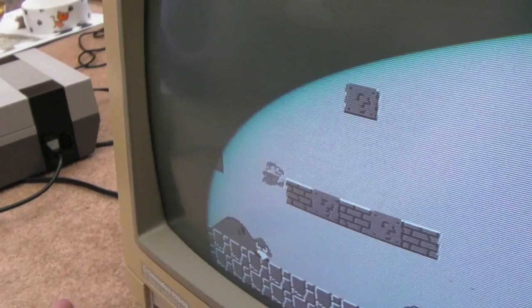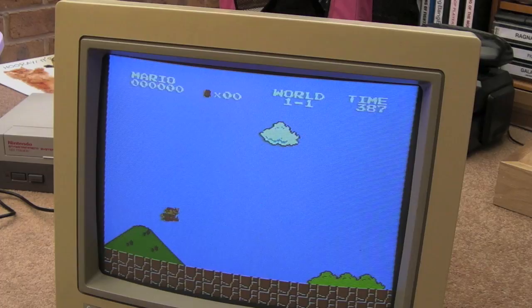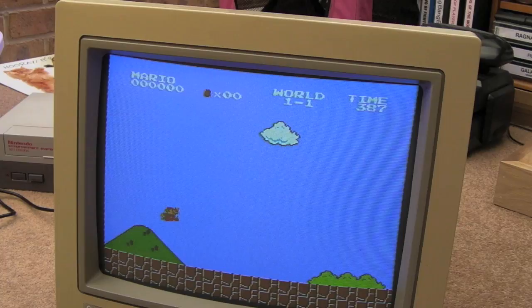It could be the chip, but I don't think so. As you can see, it looks great after swapping out that tantalum - that has solved that problem. The clue was that brown substance that had leaked around it. I just swapped it out for 0.22 microfarad 35 volt tantalum, and yeah, it's fine. So next thing I need to do is look at the collapsed frame issue, because we've still got that when it's cold - it still flickers and collapses the frame.